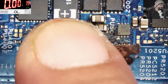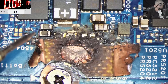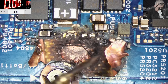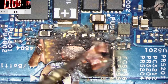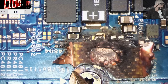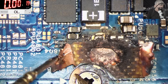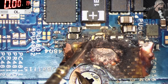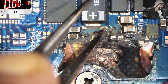This one is shorted, so we can reroute this track from the MOSFET. Definitely, we can do it. And this track is good. Usually they put tracks — power tracks — on the top, then on the middle, but this one is not shorted. No short. This one is not shorted. So we just fix the problem. What is shorted is this track — 2.5 ohms. So this one is still shorted, but this has a good chance to be fixed.